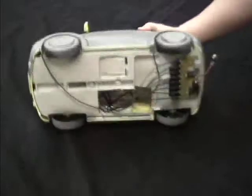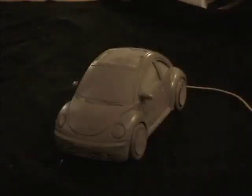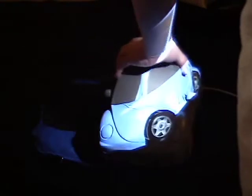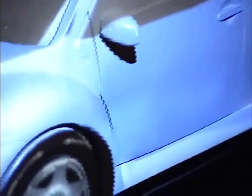Our last demonstration uses this toy car that has been implemented with eight optical fibers. These registration points allow us to use the known geometry of the model to dynamically give the car a custom paint job and hubcap details. If the car is moved, we can realign the model to fit the new perspective in just a few seconds. This previously required a 15- to 20-minute manual realignment process. This close-up view of the car shows the accuracy of registration between the projected image and the physical features of the model. Our calibration system brings these ideas of appearance customization to a closer practical reality.